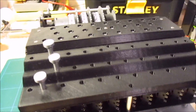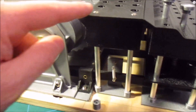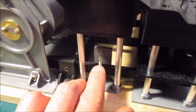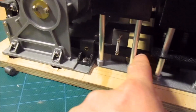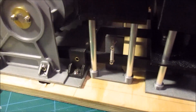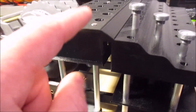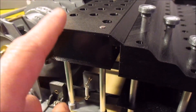If we turn this around — you can see in here the lamp board has these plastic feet at the bottom, and these are also the spring holders. Inside here there's a little spring, and that's what is pulling this compensator bar back up after you press the key. I finally solved the problem of having springs pinging off and going up a vacuum cleaner by doing this. There's one on this side and one on the other side. You can see here the extra step — this is a facade piece that clips and screws onto the front of the lamp board panel.